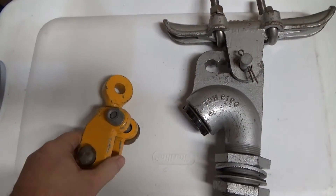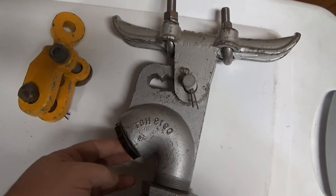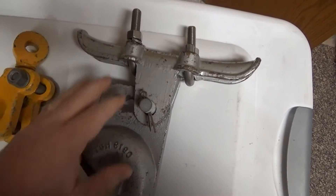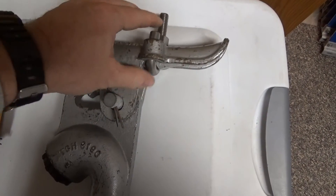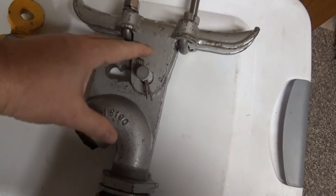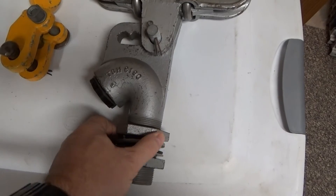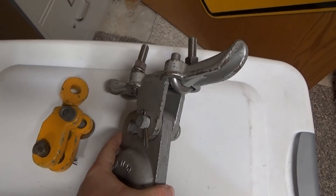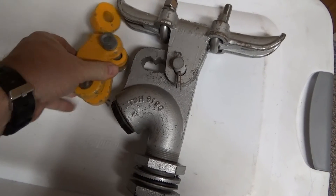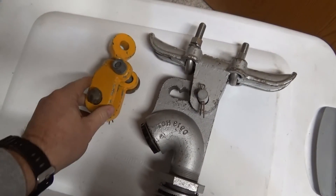Now I'll show you the balance adjuster. The balance adjuster is this little piece here. It would attach between the exiting wire fitting and the span wire saddle clamp — basically where the wire comes through. These bolts would tighten onto the wire with a cotter pin situation. The bolt comes through and you could have it direct to the light mounting itself, with the light pre-oriented and then tightened. Or if you want to be more meticulous, you could put this piece in between, with an eyelet that can be twisted to the orientation you'd like, giving you a little more adjustment.